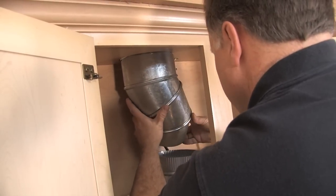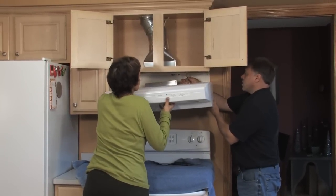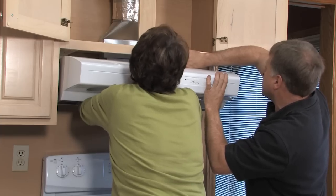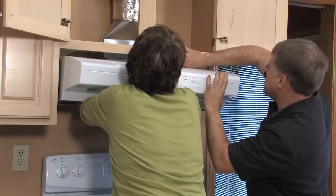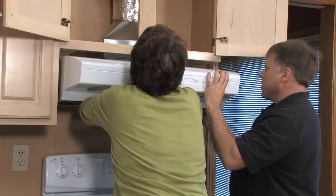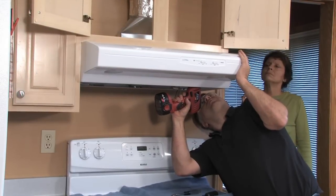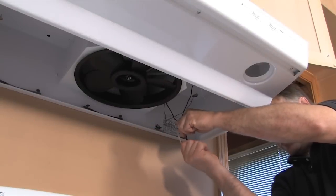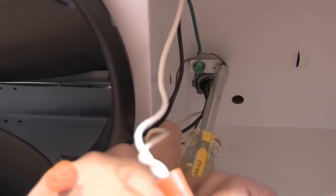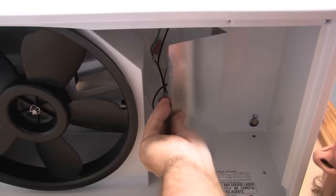The damper flap must open freely in the direction of the airflow away from the range hood. Next, connect the 120 VAC house wiring to the hood and secure with the electrical cable clamp. Hang the hood by locating the mounting screw positions on the wood shims. Start the screws but don't tighten them all the way. Hang the hood from the 4 mounting screws, then slide it towards the wall until the mounting screws are engaged in the narrow end of the 4 keyholes. Tighten mounting screws securely. Connect the house black wire to the hood black wire, the house white wire to the hood white wire, and the house ground to under the green ground screw. Make sure the cable clamp onto the house wiring is tight. Replace the wiring cover.